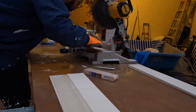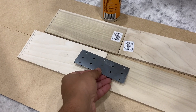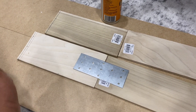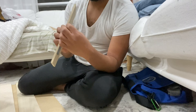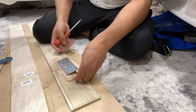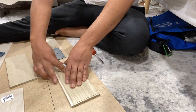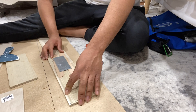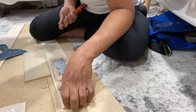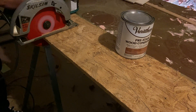Right now I'm just sizing and cutting these pieces. Since I had to get 36-inch long wood, I'm actually going to combine two pieces of wood — that's why you see this plate here; it's like a connector used during construction. I have these wood screws that are a little too long; I just don't want them to come out the other side, so I added these little paint mixing sticks. Then I used wood glue to combine the two and hold them together for a good bond. I really could have just used wood glue, but I just wanted to be sure — I'm used to nails and screws.